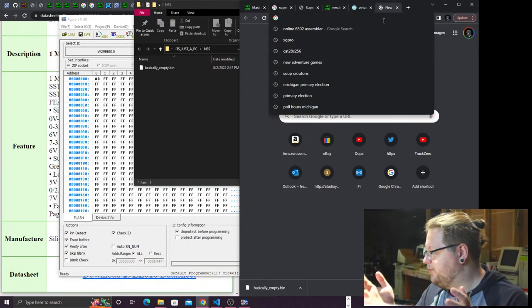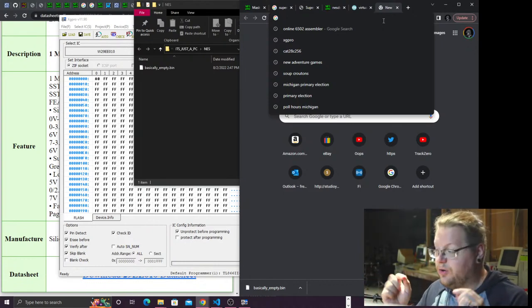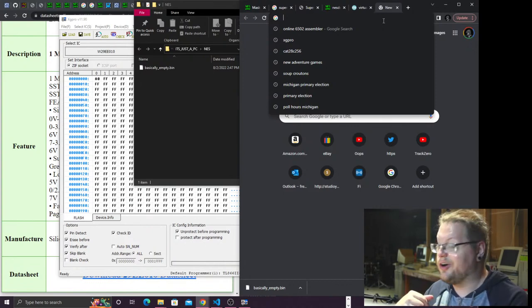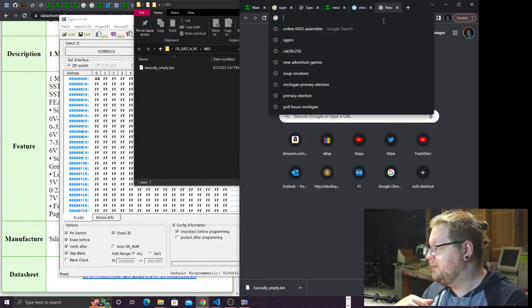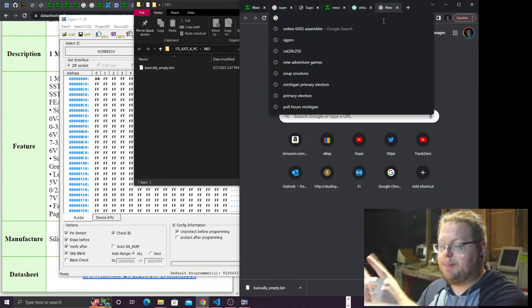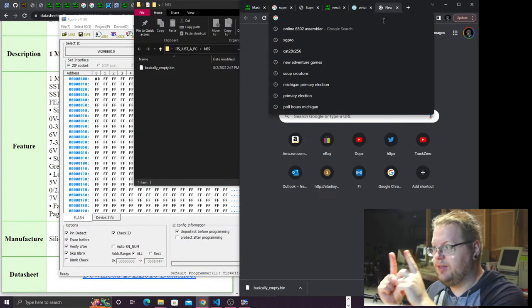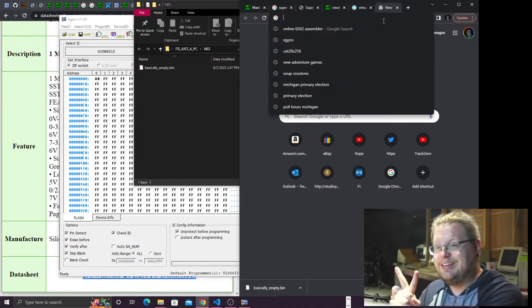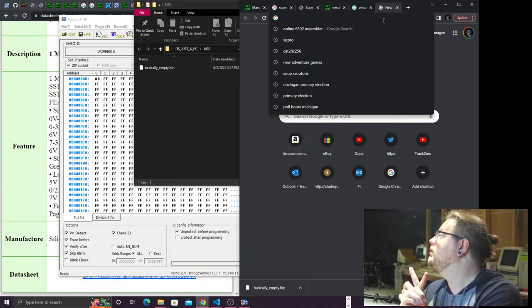So either the NES would need to have its own onboard ROM that's mapped into that location when the thing starts up in order to do anything at the beginning. As far as I know, the NES isn't smart enough. The only way to do that and also have that space available to the cartridge would be to, and 68000 computers actually all do this, have the boot state of the machine map a ROM to where the reset vectors are, and then have the boot code immediately trigger some hardware on your board to remap the ROM into a different space. And I highly doubt the NES has that kind of hardware on board. It has its own V-blank interrupt.